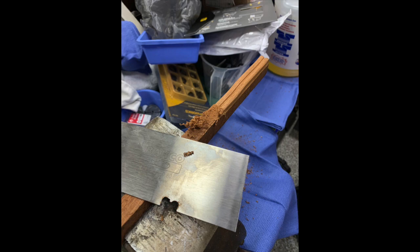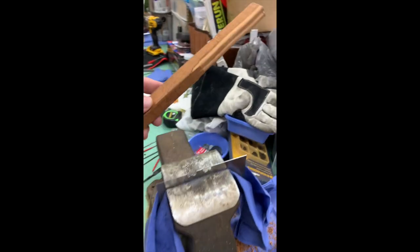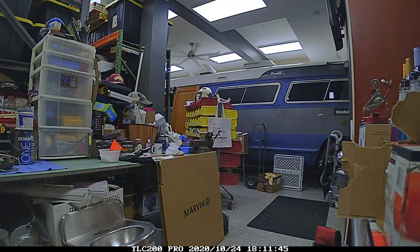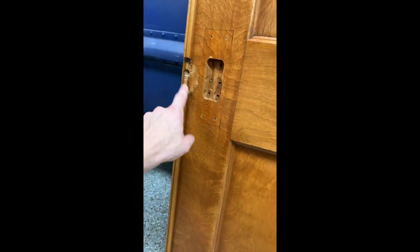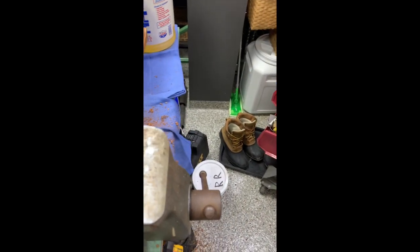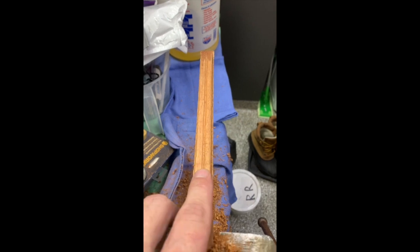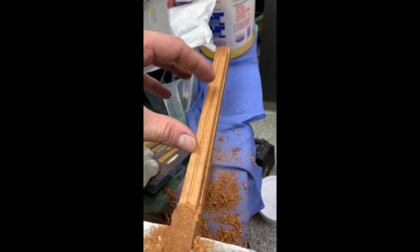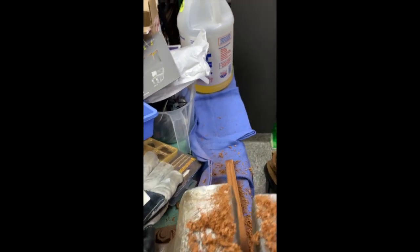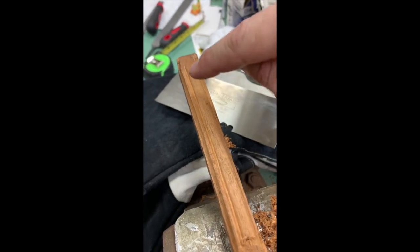I've now made this second trim mold cutout, and I'm going to make that on the backside of this or at the other end. It's a little bit of a tedious process, but really the only way to get these doors back to the condition we want and to make up for somebody's error. I redid the original side that had a little bit of a bend — this side came out much better. Interestingly, there was a little bit of a knot in the wood, so it kind of jumped on me, but I have a long enough section that it should work fine. This is then the piece I'll use for the other door.